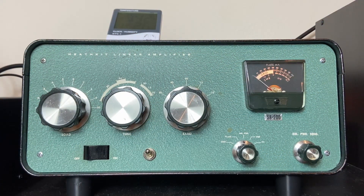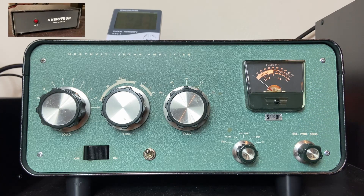The way I have everything connected here is the exciter — that would be my rig, my Yaesu FTDX 3000, it's a solid state rig — that is connected to this amp. The output of this amplifier is connected to a one kilowatt dummy load. Also, have in mind that you need a soft key, which is an interface between this amp and your solid state or modern rig, so you can properly key it.